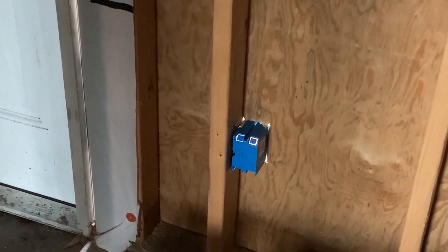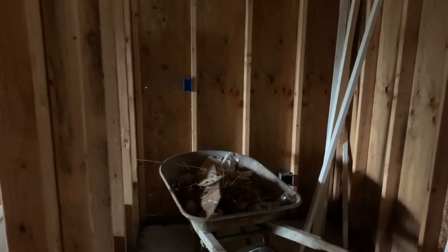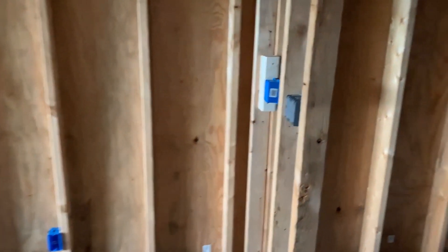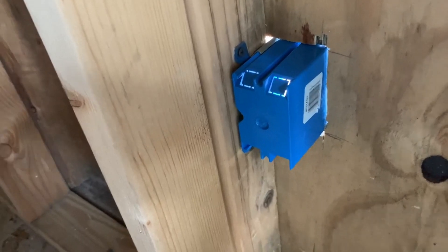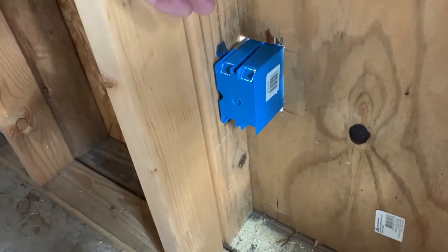That right there is for our outside receptacle — it's a GFI. We've got one in the front and one in the back. That's for our on-demand water heater and our switches, our outside light, washer and dryer, closet. Got a can light in the closet — we're going to put an LED in there. And we have our electrical outlets throughout the bedroom, switches, GFI, exhaust fan. These exterior GFIs come with a strap to fasten here, and they're adjustable and really deep — they work perfect for a GFI, especially on the outside.